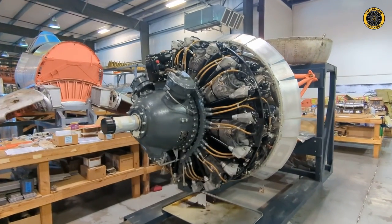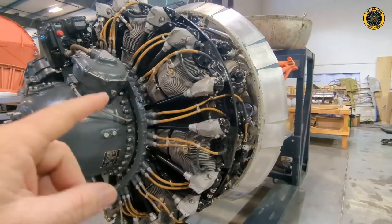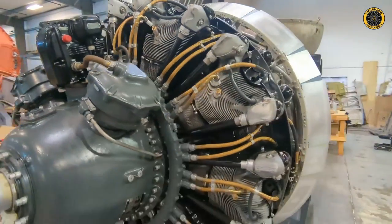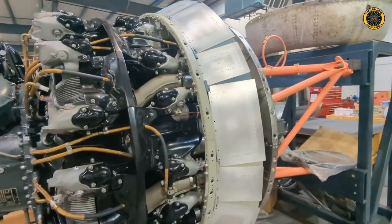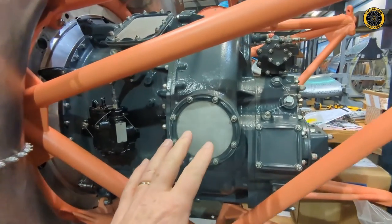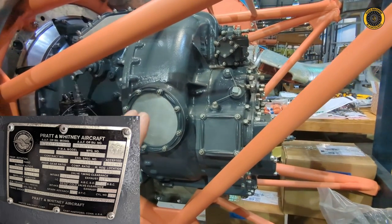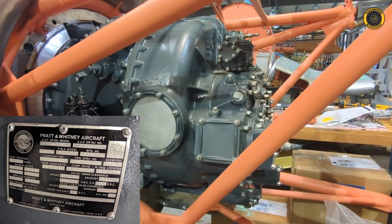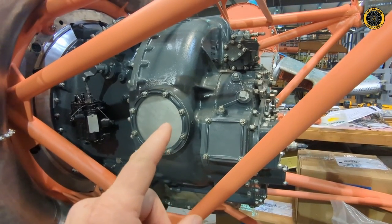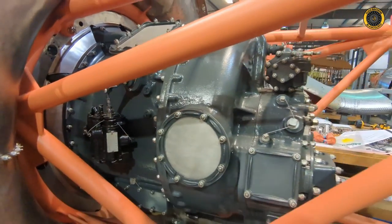We're looking at a 2800-8 engine, a rare early model 2800 engine that goes on the birdcage Corsair. Two rows of nine cylinders — 18 cylinders total, typical radial engine. These are the magnetos. There are basically two magnetos feeding two distributors that fire the spark plugs. Back here is the very rare blower section. If you look at the placard of the engine, it talks about the three blower ratios. These supercharged engines run in low blower all the time, with one stage always engaged, and you can go to the second and third stage blower by changing gears through a control in the cockpit.